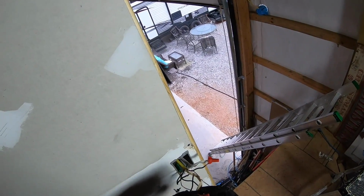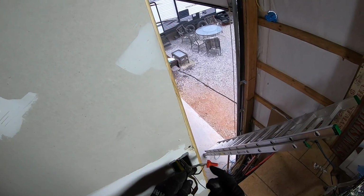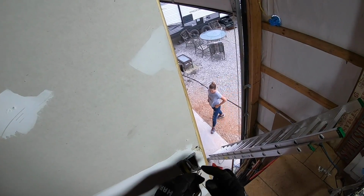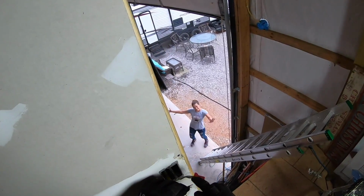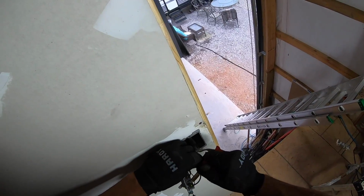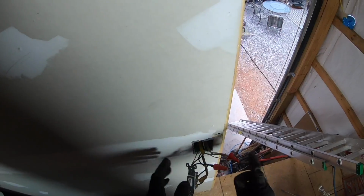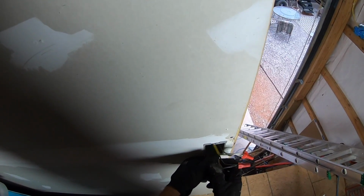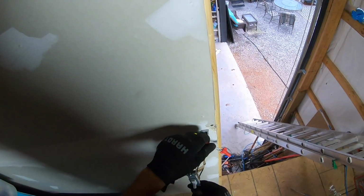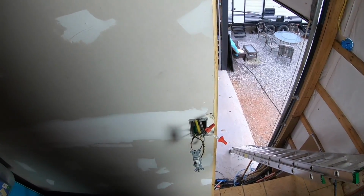Okay, and I'm using the red wire nuts because these are the larger wire nuts to accommodate 3 wires and also 3 12-gauge wires, which are a little bit thicker. Okay, tug test. Good. Okay, now I've got my ground that I'll connect to the ground wire. Okay, now I'm just gonna clean all this up, make sure everything's separated. And I'm gonna leave this out until I do the light fixture and turn the power on, make sure everything's working, and then I'll push it all back in and get the cover on.